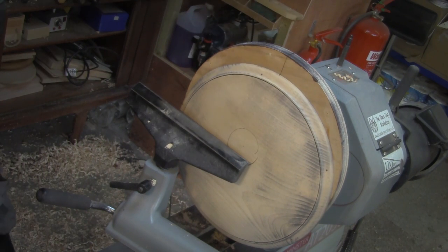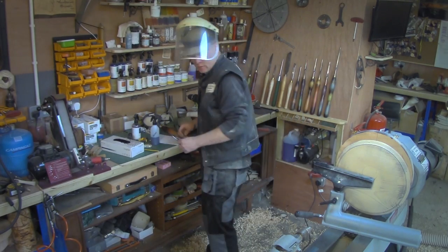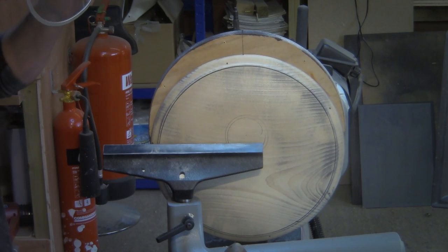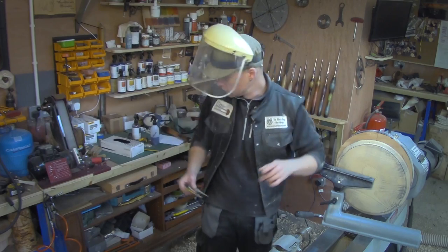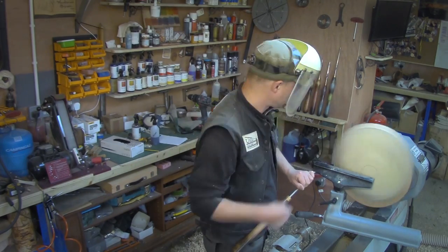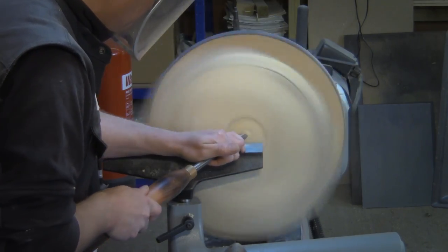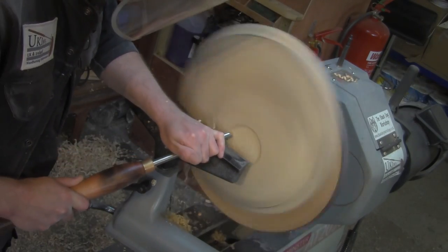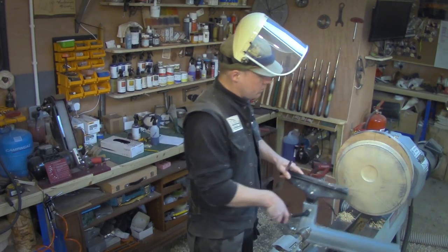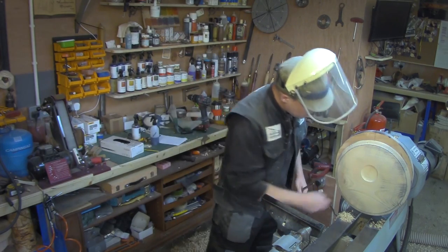So it's a little bit spirally, I know what I mean. So I want that bit flat, but I also want it flat a little way out to the outside. So I'm going to extend the radius, is going to go flat. Yes, that's what's going to happen. Right, so I'll just flatten that off. There, that's okay. Remember to take your ruler off the lathe bed before you move the tool rest back. So I'm happy with that.